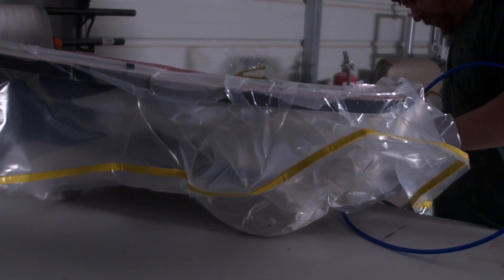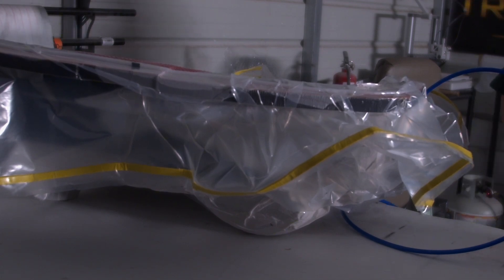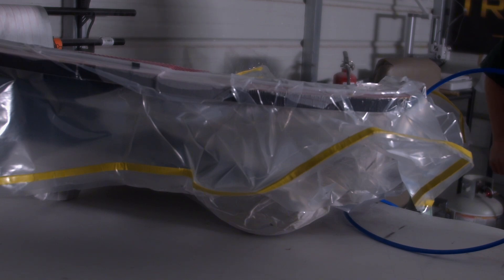The vacuum bag was really big. I had to make sure not to tear it while putting the 3D printed tool in. Towards the bottom of the mold I put some fabric breather cloth on it because there are some rough spots where support material could puncture the bag, just to keep it from ripping during the infusion. The order goes like this: you put your carbon materials on, then peel ply, then your red infusion flow net. From there you put it in the bag and get your vacuum and inlet set up. This is kind of a time lapse of infusing — you can see the infusion runs from the middle out to the outsides of the mold. You can clearly see the infusion fittings there. They worked really well.